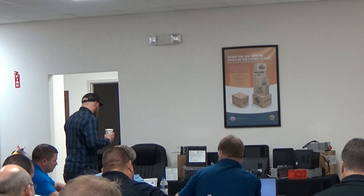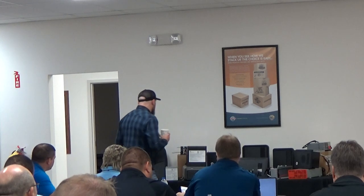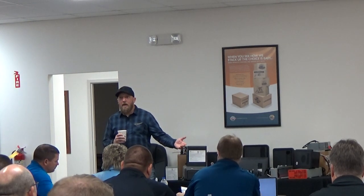So if you go to the next page, it's starting with WFCO converters. We have a mix of everything up here. So when we talk about converters, we're talking about a few of the products up here. But the first thing is, what is a converter? Does anyone here know what a converter does? I'm not sure what other products you guys sell, but a converter takes your 120 volt house power and converts it into 12 volt battery power.